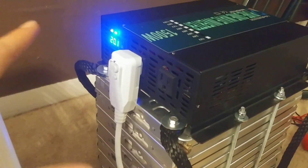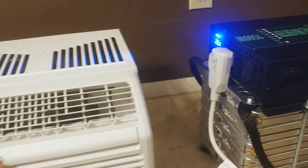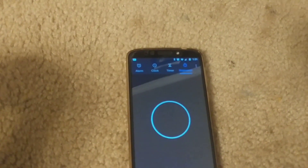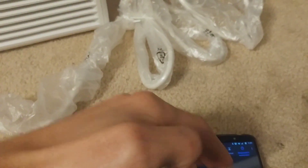Alright, we are shut down. The recovered voltage is 20.1 volts. The indicator light is still on but the unit doesn't turn back on after shutdown — which is perfect. It shuts off silently in the middle of the night. So what do you think the runtime was? Four hours and 10 minutes. I'm a bit disappointed — I thought it would be closer to five, maybe six hours. It started dropping fast once it hit 22 volts — the voltage just started tanking pretty significantly.